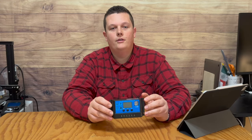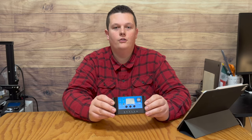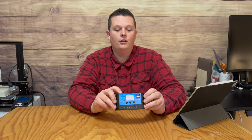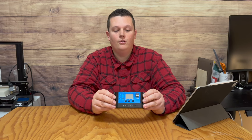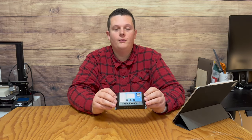One of the most important steps during setup is connecting the battery first to the solar charge controller. If you don't do this first, the computer inside of the controller will mistake either the solar panel or the load for what it thinks is the battery. So just make sure you connect the battery to the controller first before anything else.